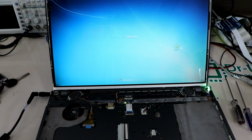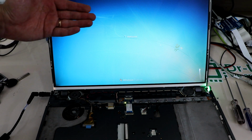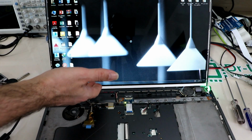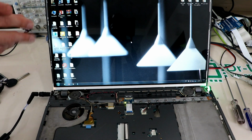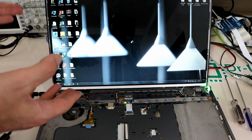So this is it. Hope it would be of use for you. You can easily repair panels of LCDs that don't have backlights by removing their LCDs and T-con boards and changing broken LCD backlights. Then you can easily fix their problems.